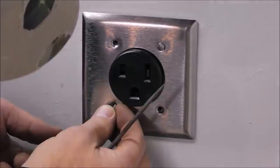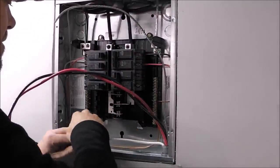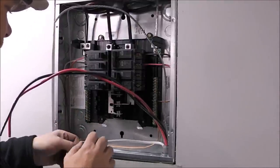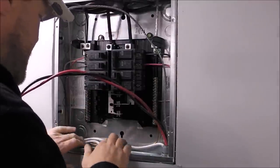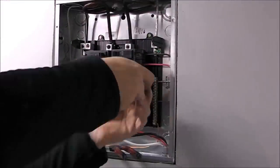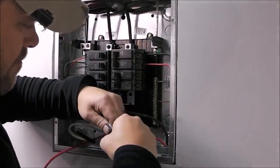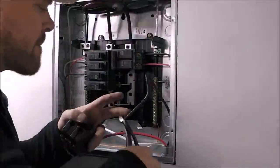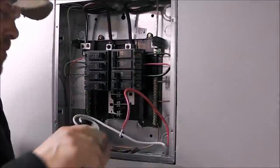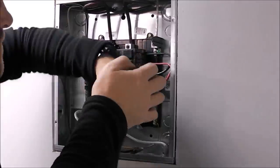Make sure your screws are up and down and everyone will think you hired an electrician. We're going to do the same thing with the neutral up at the panel that we did at the receptacle — we're not going to use it, so I've capped the end and coiled it up neatly inside the box in case we ever need it. I always like to hook up the grounds first, then the neutral second, then all the hot wires last. Here I'm making nice sweeping bends on the hot wires, applying non-corrosive additive to each wire, holding it up, stripping it, adding the additive, placing it under the lug, snugging it down, then pulling it out to check it's neatly under the lug before tightening fully.